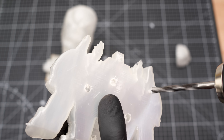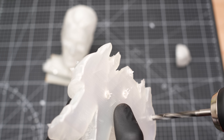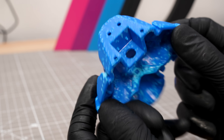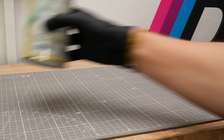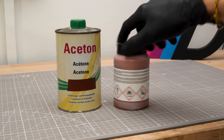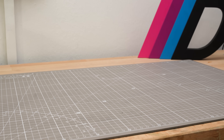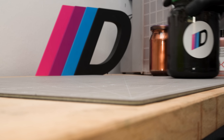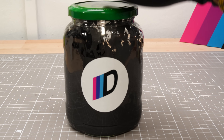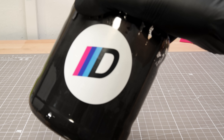Now I'm drilling venting holes into the smooth prints so the electrolyte doesn't build up too much pressure inside. I didn't have to do that for the resin prints though. And now comes the most important step of electroforming: the conductive paint. I used two types of paint that work really well — copper paint mixed with acetone for airbrush application, and as a solid alternative, graphite paint. Graphite might even be better but it's a lot trickier to handle.